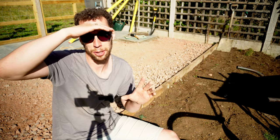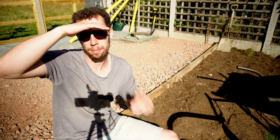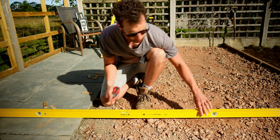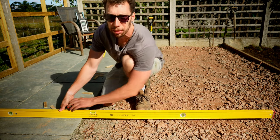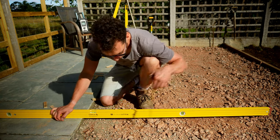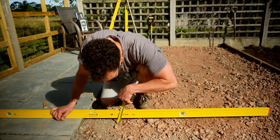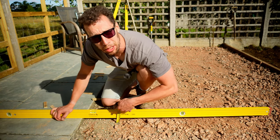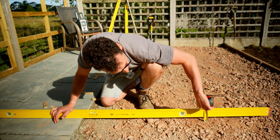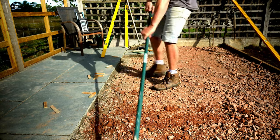The key to any good patio is the preparation. You could dig out more hardcore but definitely don't do less — a good patio needs a decent amount of hardcore below it. With the wacker plate still here and a couple of rows of slabs laid, I'm using a long level on top of the slabs and dipping my tape measure along to make sure I've got enough depth for my cement and slabs — aiming for two inches total. I'm a touch high in places so I'll rake it over and then run the wacker plate to harden it before I start laying.